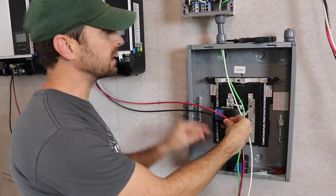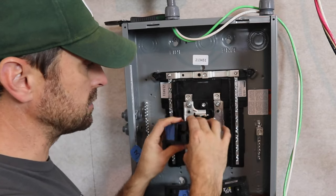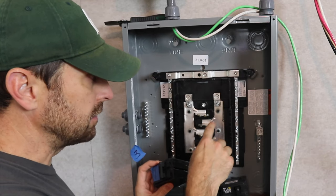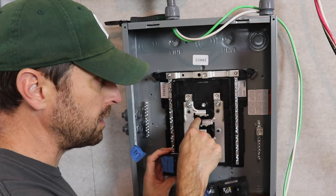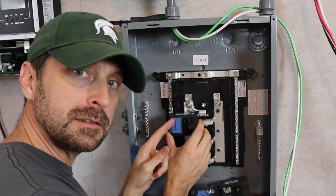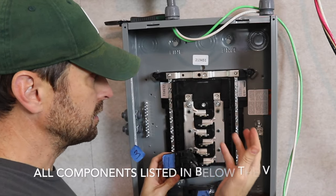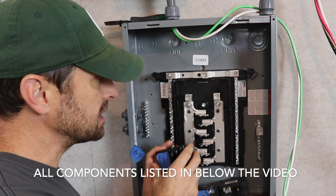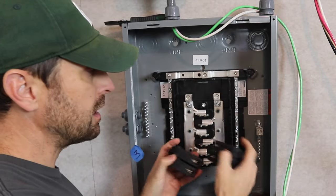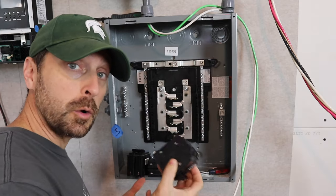With this inverter and the transformer — same exact thing. In our breaker panel we've got our breakers, and when you have one on either side like this you need to keep the poles the same on each breaker. Some boxes are flipped so that line one would be on top on one side and line one on the bottom on the other. This is a Square D box and they're the same — so if I plug this breaker in on this side and this one on the other side, they both contact the top on their line one, and line two is on the bottom. That's really nice for keeping things organized.